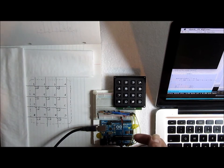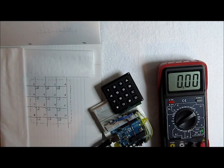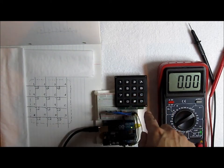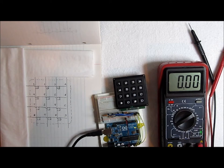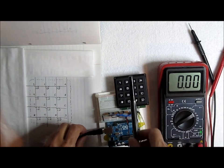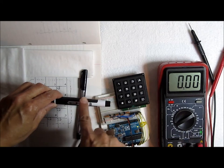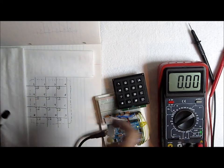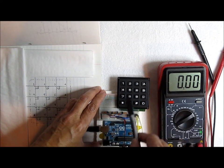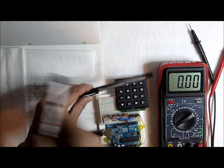What's more interesting than the demo is how I actually read it. Let me move this out of the way, get a multimeter, and talk about how it actually works. Inside one of these keyboard matrices is basically a grid of wires — four going across and four going down — and they're not connected to each other. Wherever there's an intersection, pressing the switch will connect those two wires. By sending a signal one way and seeing which output pin has voltage, we can detect which key was pressed.